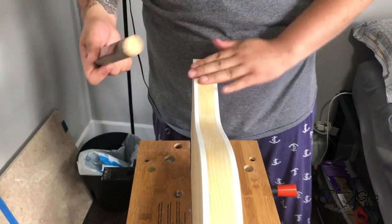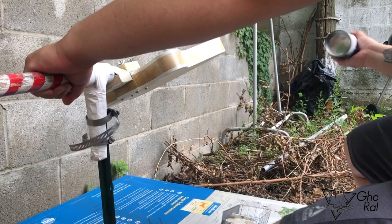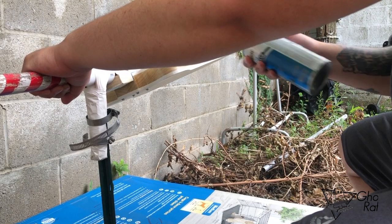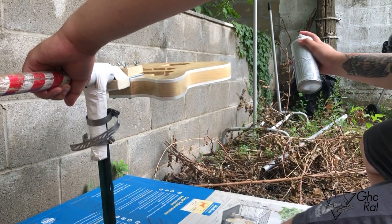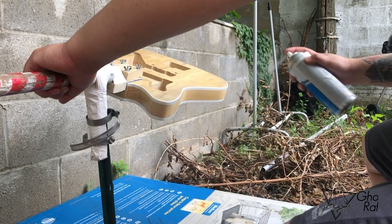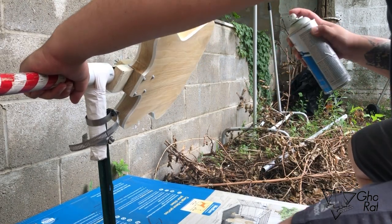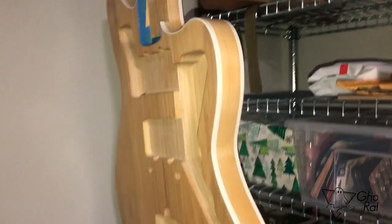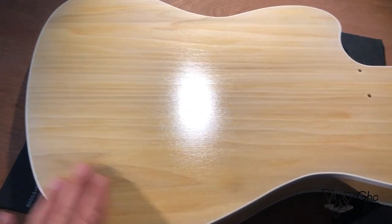The scraper I used here is a furniture scraper — got it from Amazon, really easy to use — just to flatten it out. With 400 grit sandpaper, I took time doing that. For the paint, this is a polyurethane water-based paint, one coat every two hours of drying time, so I did 10 coats. It took me about two days. Thank you to Josh and Hinchot for letting me use your backyard.